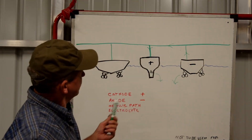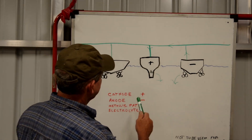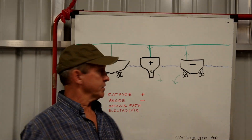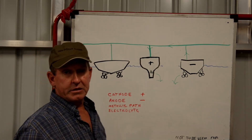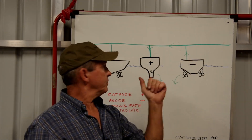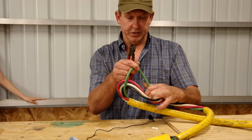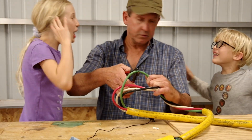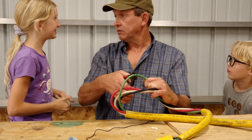We think: how do we interrupt this? We could take our boat out of the water — remove the cathode or anode, the process stops. We could remove the electrolyte — get out of the water, the process stops. Not really practical. Or — what if we cut the safety ground? 'I know how to deal with this, I'll cut the wire and stop that process!' NO. Scary idea — I would not do that. Very bad idea.